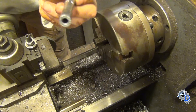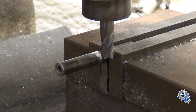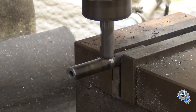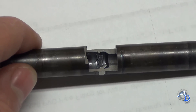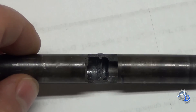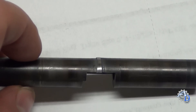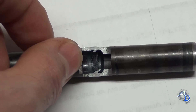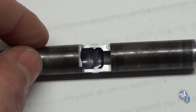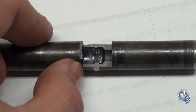There are no voids or anything in it — that's kind of cool. Now I'm going to take a half-inch carbide end mill and do a cutaway view of the inside of this weld. Here's the cutaway view of the same tube. I cut away half the diameter to give you a clear view of the weld on the inside. You can see where the material rolled and displaced on the inside, just like it did on the outside. You can also see where I pocketed it with the 3/8 drill and then the original bore of a quarter inch. It seems like a pretty substantial weld — it withstood the cutting pressure with that end mill just fine.